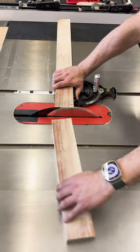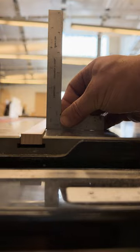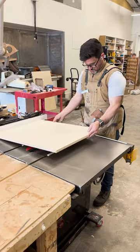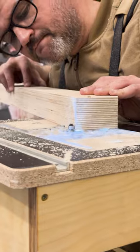Now let's put together this super accurate crosscut sled. We're going to put our runners on by using some washers to raise them up and some super glue. I like to use my table saw fence to get it sort of square to the runners. You're obviously going to square it up later.